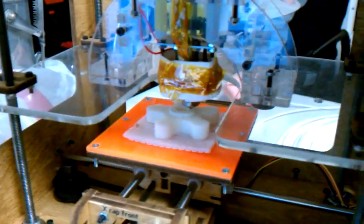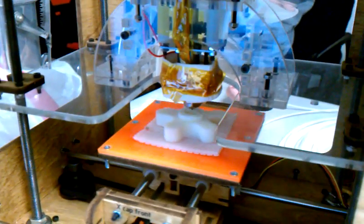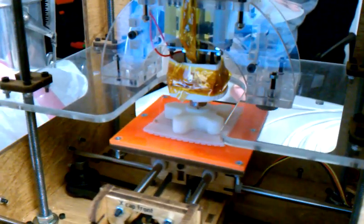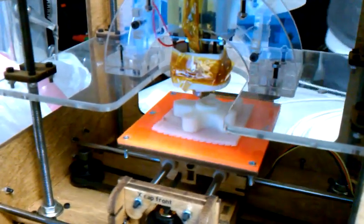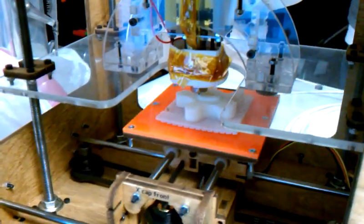This is kind of where you want to set those pauses up where it's just running around. This is the area where you might need to start tweaking your Skeinforge profile to optimize it for your machine. Each machine is a little different with its own personality.